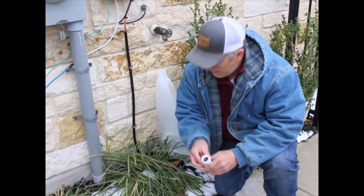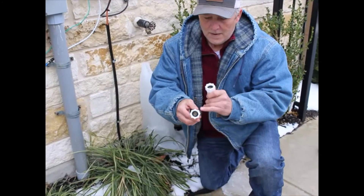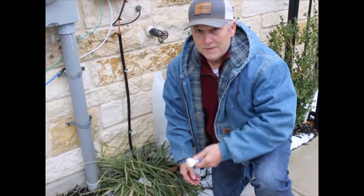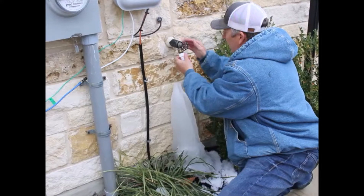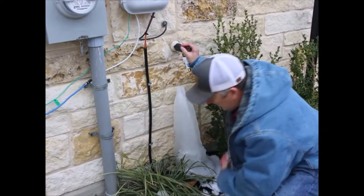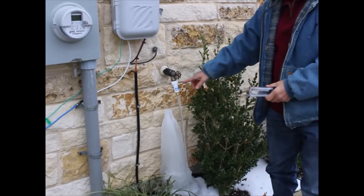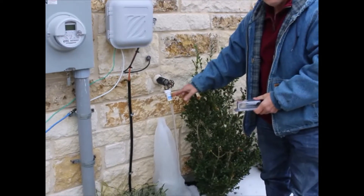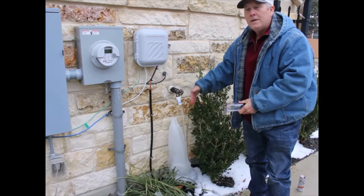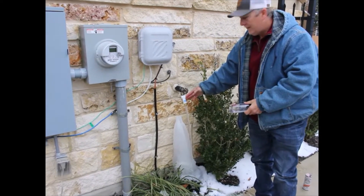Take it and bring it in the house for about an hour. After that, the thermal wax will thaw out and the rod will come completely up. Or you can simply take it in the open position, screw it onto your faucet, and stand back because the water is going to be running. After about two to three minutes, the thermal wax in here — due to the warm water — will thaw out and completely shut off. From that point on, it will go back to a drip rate that it needs to maintain in order to keep your faucet at 37 degrees.